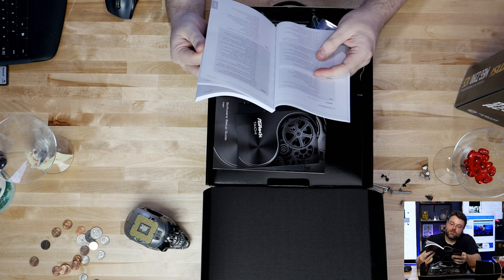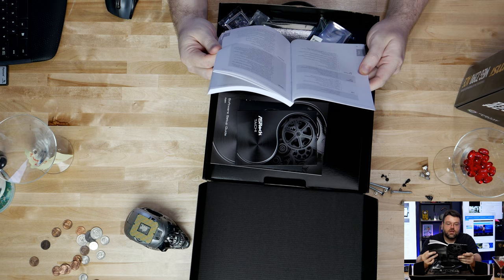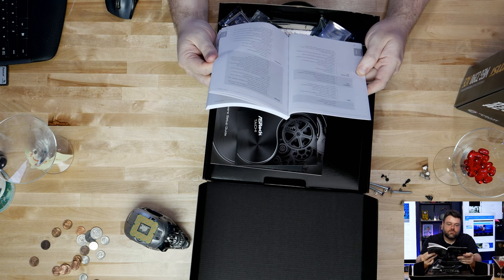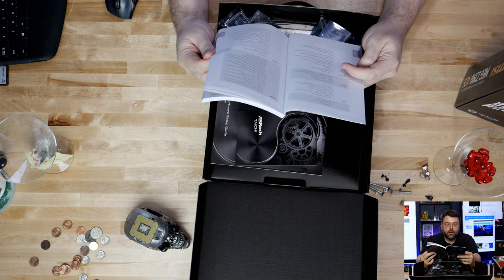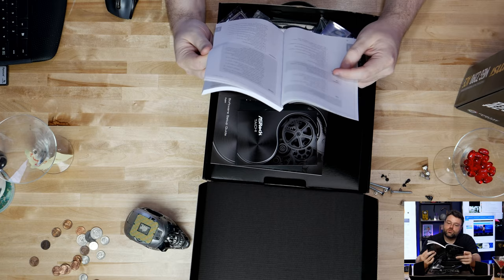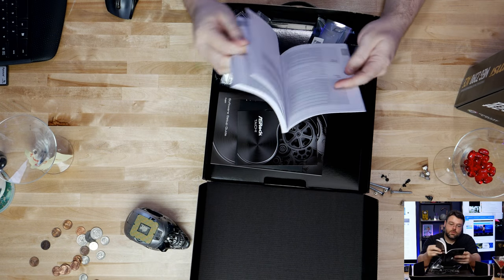So this is a Realtek ALC1220 codec, audio, Nichicon Fine Gold audio capacitors, NE5532 headset amplifier for up to 600 ohm headsets. 2 Intel Gigabit NICs, 1 I219V and 1 I211AT. So dual gigabit NICs, it can do teaming on Windows 10 Redstone 2 and above, Intel Wi-Fi ABGN AC. I saw somebody in the chat calling for Intel onboard NICs. Well, there you go. Three USB 3.1 Gen 2 Type A, one USB 3.1 Type C, four USB 3.1 Gen 1 ports from the Z390 chipset, clear CMOS button, storage. Storage supports M.2, the U.2 kit, and NVMe SSDs as well as Optane drives, so that's good. Nothing untoward there.